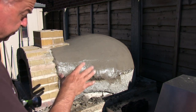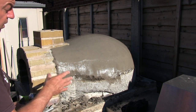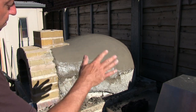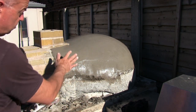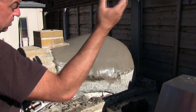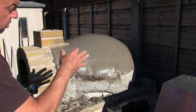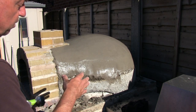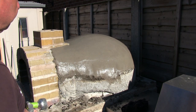One of the most important things with anything like this is don't let it dry out too quickly. So I'm going to give it a very light misting with water and construct something over the top with a polythene sheet — the polythene sheet doesn't touch the wet mortar, but it stops the sun from drying this out too quickly. The first 24 hours are crucial. A nice slow curing process — take the plastic off after that and then just allow it to dry out naturally.